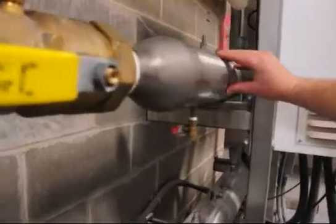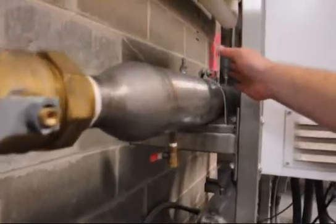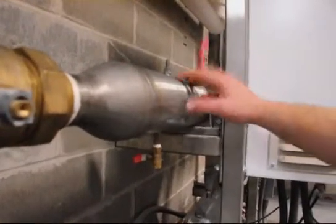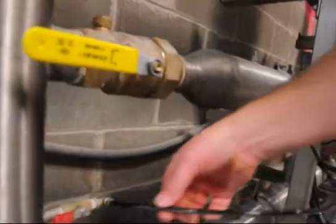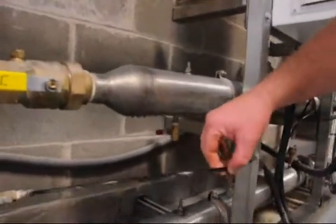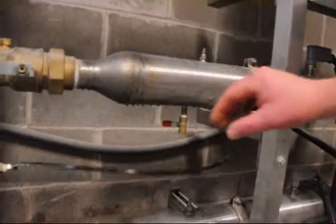The water cools the electric motor. On the other side is the pump, which is attached to the motor, also inside of the pipe. On the suction header you have a sensing line. If the suction pressure drops below a preset point, the pump shuts off to save the pump.